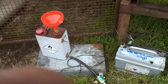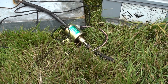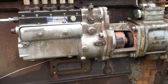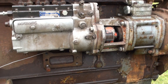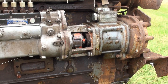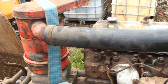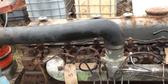We'll start with the fuel supply. As you can see here I've just got a five-litre can with a bit of diesel in it which I'll keep topping up. Down there is a little 12-volt electric fuel pump off eBay pushing the fuel up through a filter and into the Mini-Mec pump. There you get a good view of the coupling bolted onto the back of the vacuum pump. It did have a foot-mounted CAV mechanically governed pump so I had to put the alloy mount on off a 1060 to receive the Mini-Mec, and you can see all the pipes have had the ends changed because it was a different size nut. And we've got a 465 air filter pressed into service just to stop the birds going down the intake.